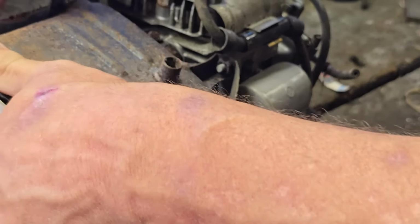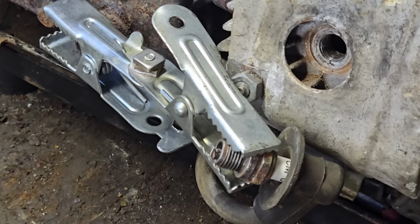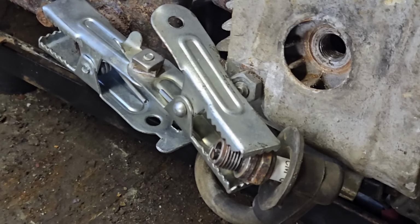Let's see if by any miracle that has a spark. It might do, it might not. So we'll come on this metal exhaust. We'll nip this plug in here. There you go. If you look in that little gap, we'll see if we've got any form of spark. That's providing the switch is in the on position. Right, I'm going to connect the wiring back up, guys, in case that's connected to the kill switch. So I've got the front wire connected back up. The generator connected back up.